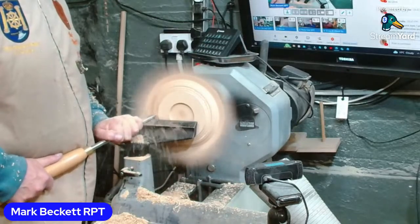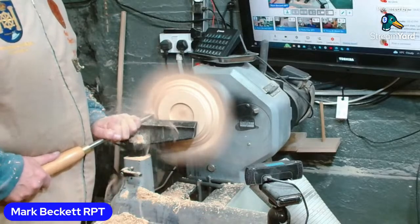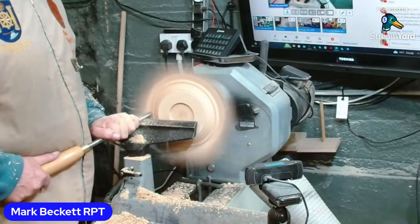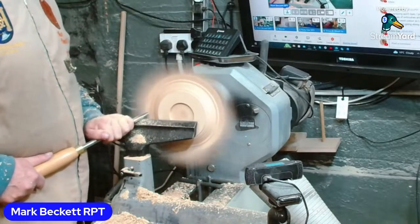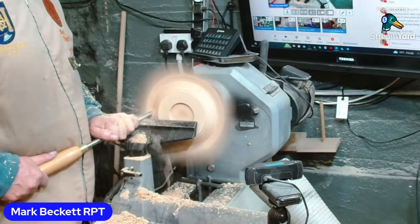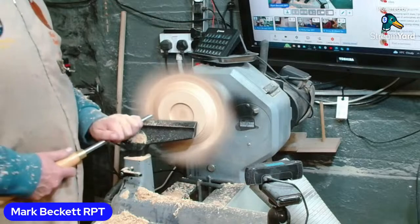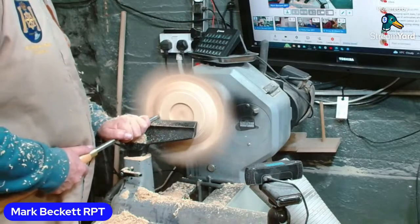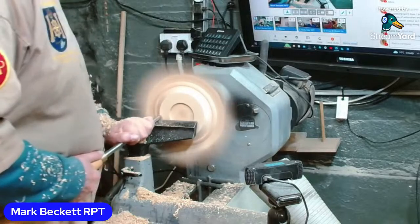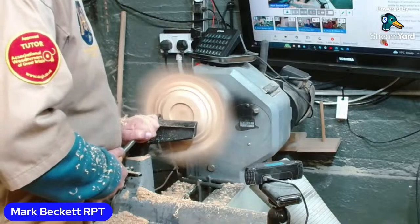Woodwork Intermediate says he's got at least five airbrushes, but he's got to get around to using them. Now, Paul said for spraying spirit dyes, he prefers a siphon feed type of airbrush because he has a different bottle for each color, so you just swap the bottle as he's going along. Seeing as how I've got this set, because I'll probably use maybe two or three different colours on one piece, I have different airbrushes, so I just need to swap over the airbrush.